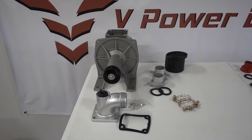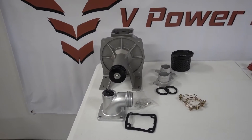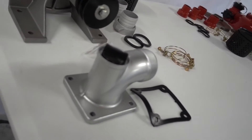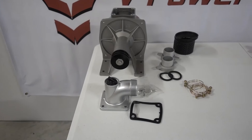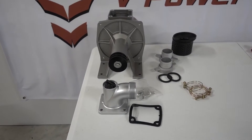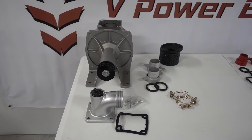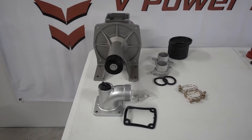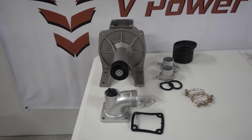It should have somewhere between 6 and 8 horsepower to drive it with a gasoline engine. With electric I believe it's slightly less — around 3 to 5 horsepower should do it. The engine should also turn this pump at around 3,600 RPMs. If electric engines turn much faster, you would put a smaller pulley on the engine to slow it down, or a larger one if it's turning slower.